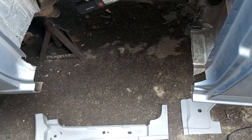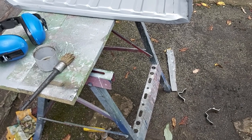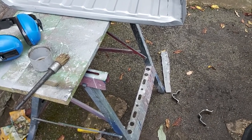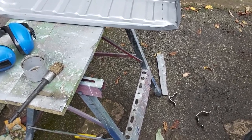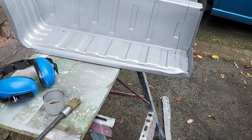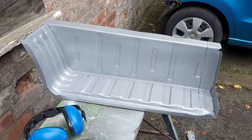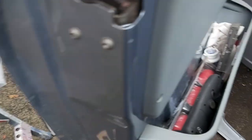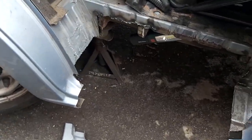This is the full inside footbed, inner sill and outer sill job on a Mark 7. The panels I bought were galvanized — I bought the left and right hand side from a company, cost about £145 GB pounds for both. It actually worked out cheaper to do that so when or if I need to do the right-hand side I can do that later. The individual panels are about £50-£60 a piece, so for the cost it was worth getting all the bits knowing I've got the inner, outer, and middle covered.